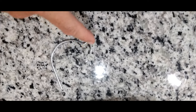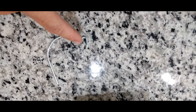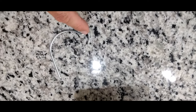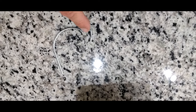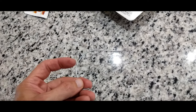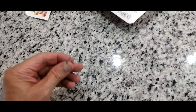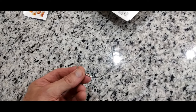A quick tip: when you push this in, there is going to be a quarter-inch difference. So you want to add a quarter inch to your measurement and that'll give you your center. If you're as OCD as I am, that'll give you your exact center. If not, you're just going to be a quarter inch lower than your original measurement. Another quick tip: this is supposed to go into the drywall and then you rotate it 180 degrees, which brings it up into the wall — so in other words, you go straight in, then you turn it 180.